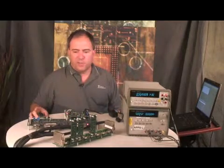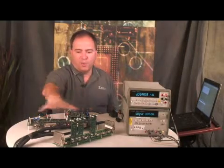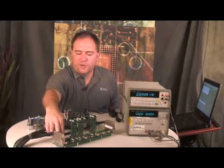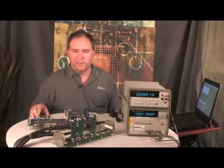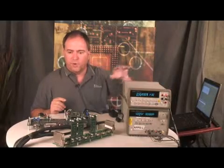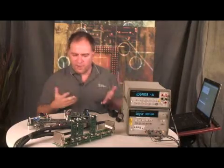The reason for this functionality test is: once we've determined whether the device is good or not, we're going to apply continuous power to all the devices connected to this multiplexer unit. The reason for turning off power on units that are not functional or not connected is that if a unit is shorted out or damaged, you wouldn't want to bring down the entire power supply for the system. So bad units are turned off and good units are turned on.